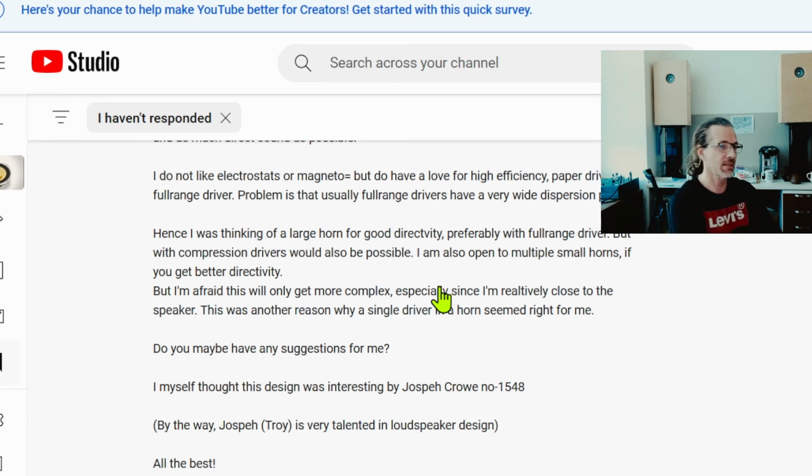and that is also something that I'm pretty curious about. Maybe you could also try that in a small room: have really big cabinets and have the bass by a bass reflex cabinet, and have the woofer crossed over at 200 hertz, or maybe 300 hertz at most, so in the region that's quite below the spatial discriminatory region of the brain, which is above 500 hertz, so have it crossed below 500 hertz and have the compression driver or drivers fire up above 500 hertz,